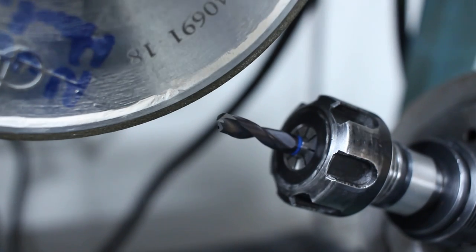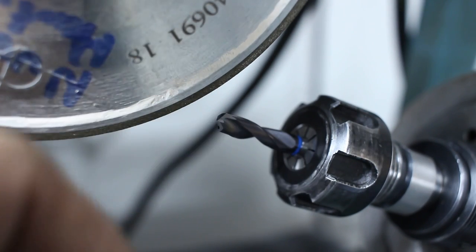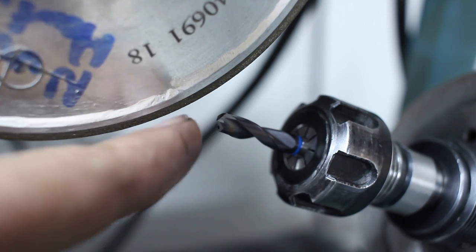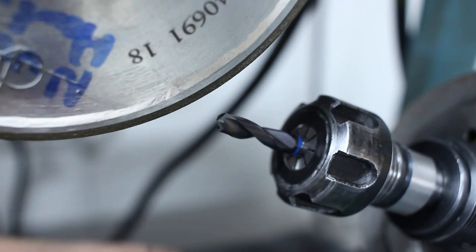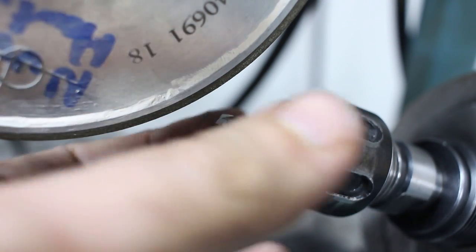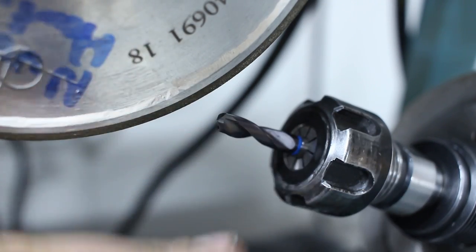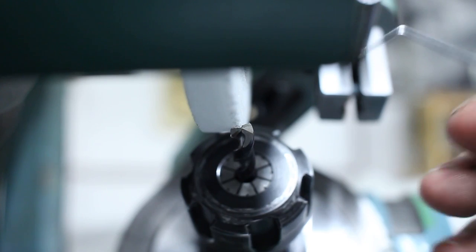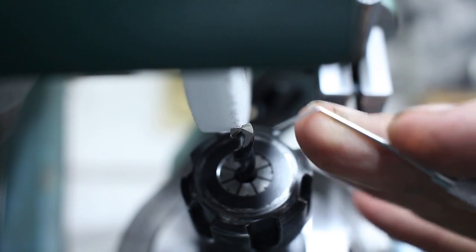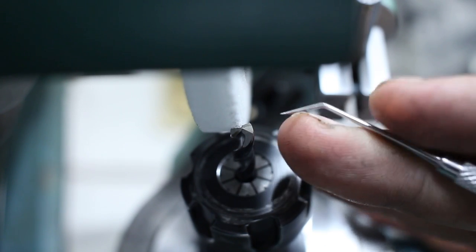There we go. And the nice thing about this setup here on the tool cutter grinder, once you have established your side-to-side travel, you just have to switch through the drills you want to thin the web and just control your down feed. This is another drill. This is a high-speed steel parabolic flute drill that I also did a four-facet grind on.